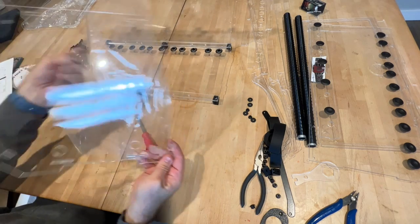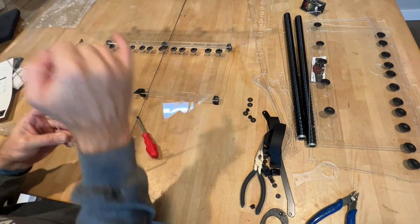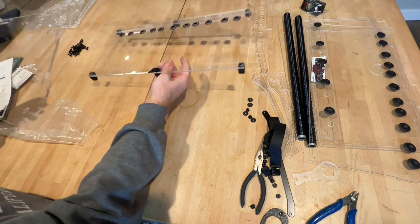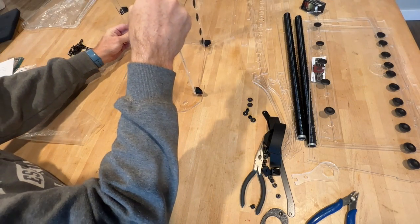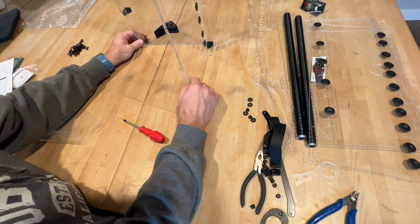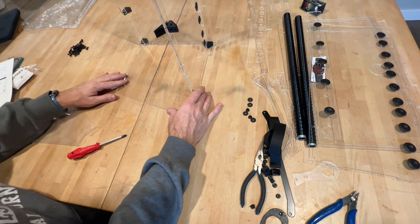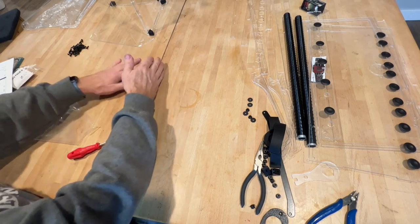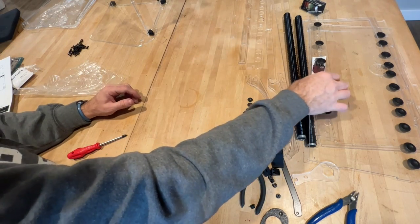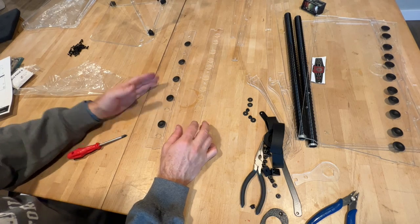Next we are going to take an inner side panel — that's the side panel that has the holes for the slip rod and all of the slots for the tabs on our center. We're going to lay this flat on the table. You can see we're going to tip the assembly in end, and you'll notice the slots for the back and the bottom are lining up. Lay it in there for right now as a placeholder. Then we're going to do our exit panel sub-assembly.